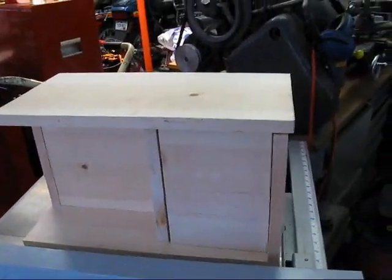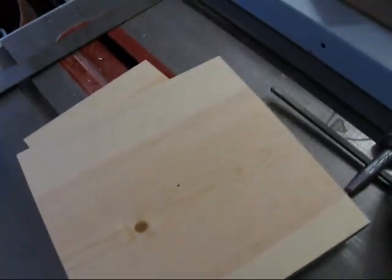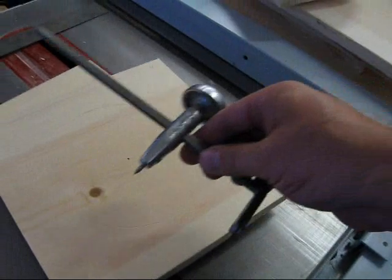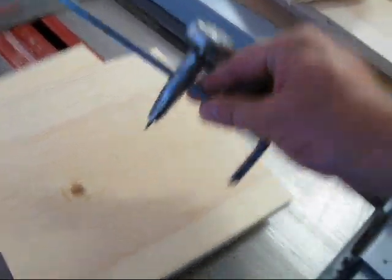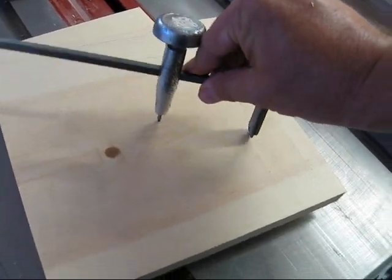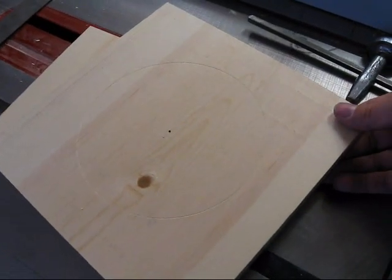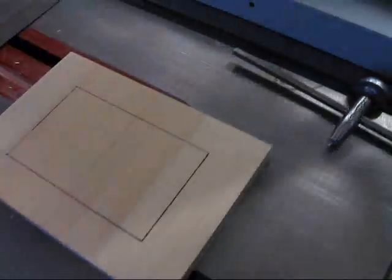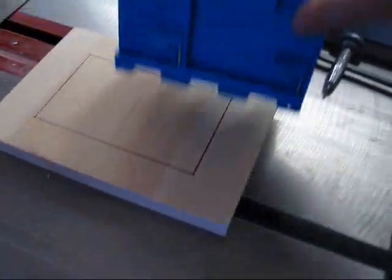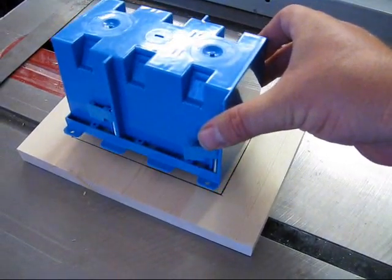That's basically how it'll look when it's done. For this one, I used a woodworker's circle scribe to get my hole, which I went around like this. See where I scribed it? That was a six-inch hole for the meter. And for this one, I used a three-gang box — I just centered it and cut it, using it as a template.